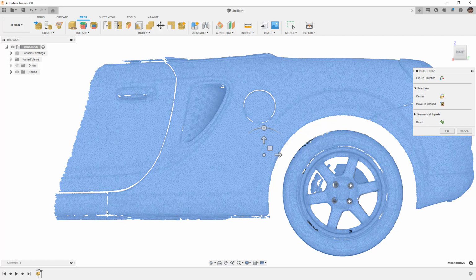But when we have this car, we've got this sort of natural seam or body line. And the reason that's important is because as we're designing a flare, we can use that as a natural takeoff point. So when you look at factory wide body cars, especially ones from the 80s, like the Audis, anything that had a boxy flare to it, a lot of times you'll see that they start and end at gaps, like door seams, right?